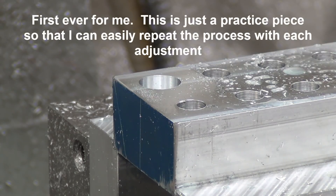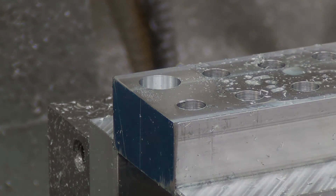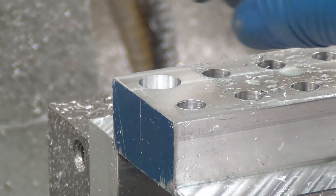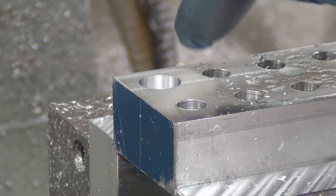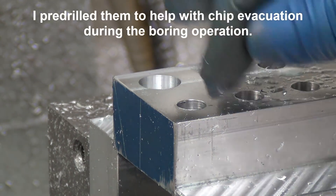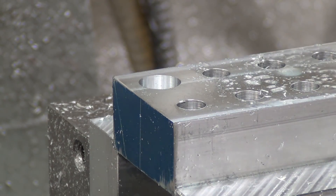This is going to be the first ever thread milling. I've got the rapids turned down 50%, feed rate turned down to 50%. I've drilled the holes — the boring creates the minimum diameter that will be in the valley of the bolt. This is slightly undersized at 0.578, which should be the tap drill 37/64s for a 5/8 by 18. I wanted to start out a hair undersized. We'll see if it's too tight; I can increase this when I bore the next one. This way they're all pre-drilled and I don't have to do any drilling or facing.